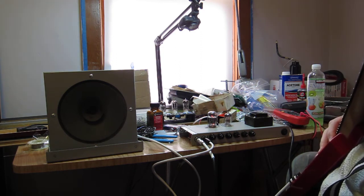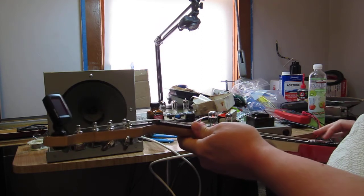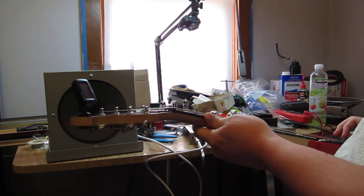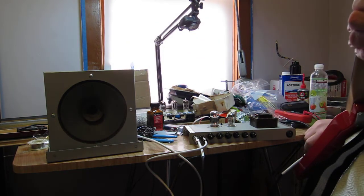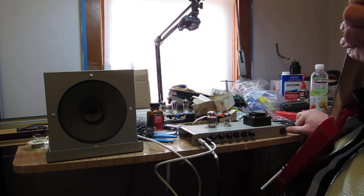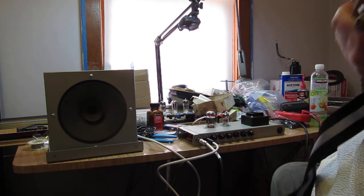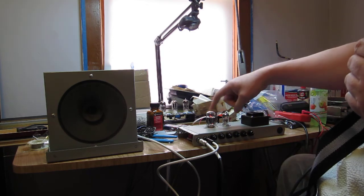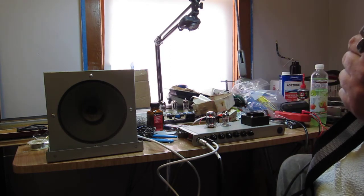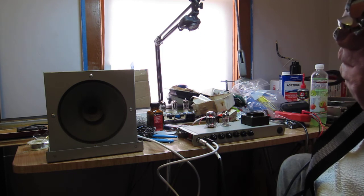I'm going to turn on my tuner here — it can verify that I am not really in tune. But it's not like I know what I'm doing. Since I'm using a clearly different transformer than the original design, I'm going to need to go through and check some voltages. I think the heater wire looks a little happy, so I'm probably pushing more than 6.3 volts here. But I think it worked.